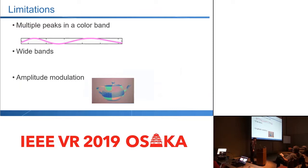Other limitations before I close: the peaks in one color filter, given one phase value, are actually multiple — because our optics uses only a single modulator layer. Prior works suggest there is a possibility of cascading these light modulators several times, which can sharpen and narrow the color band. That's one option to explore. Also, what's missing in our system is amplitude modulation, because it's only a phase modulator. Perhaps we might combine a DMD chip, then you can combine both amplitude modulation and color modulation.